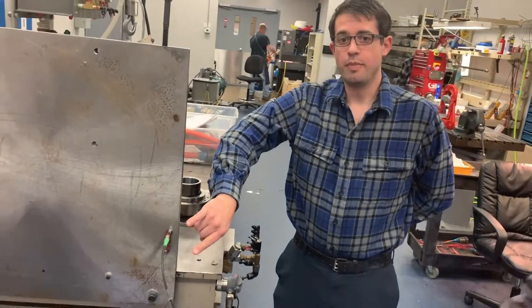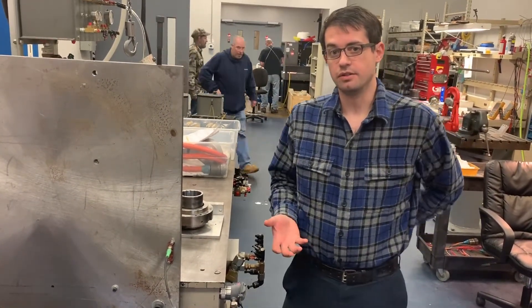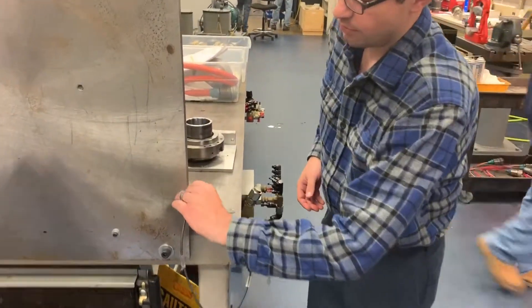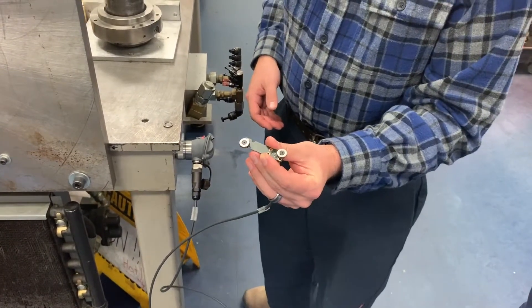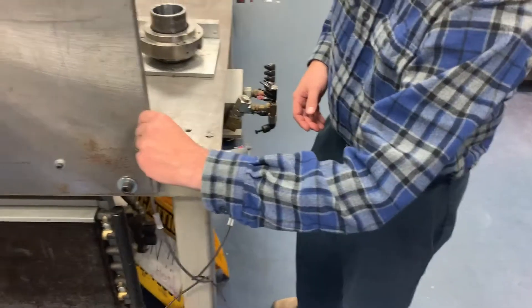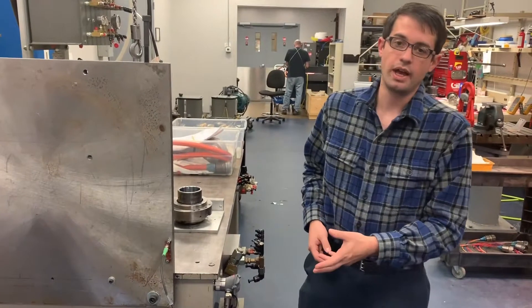That's really important — these are mounted with magnets. Traditionally, people think of strain gauges as requiring adhesives and lots of preparatory work. But all you did was put it on that piece of steel. There are two magnets and we're looking at strain levels low enough that these magnets have enough surface grip and the friction is high enough that you're able to see the strain through that.